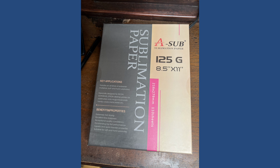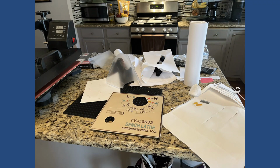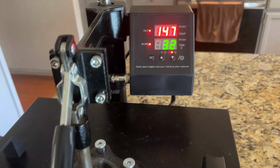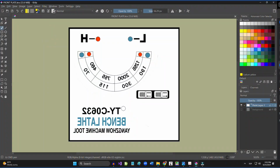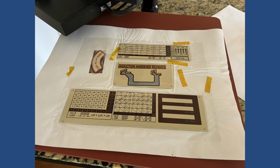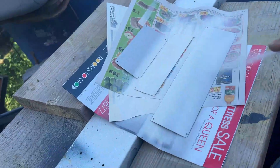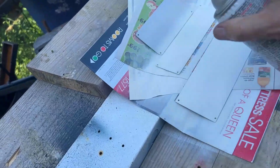What allows you to do is just transfer whatever you printed into a surface that is made of polyester through a heat press. The first thing you had to do is just create the graphics on a paint program and then just print it into the sublimation paper. Then you heat press it into a polyester based substrate or surface, or you can directly print it into a special vinyl that is made to print stickers.